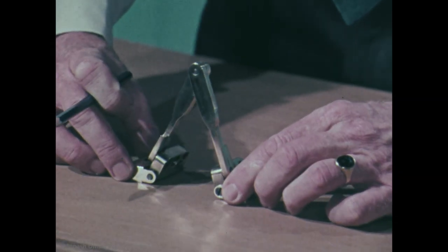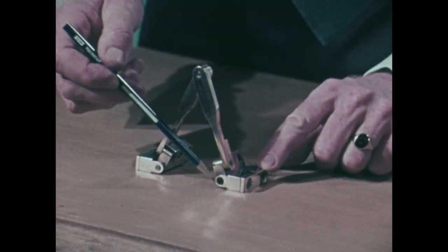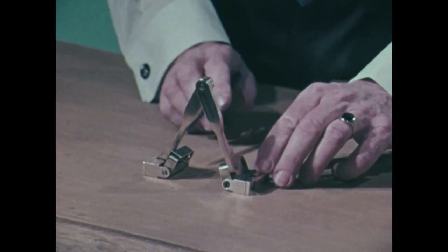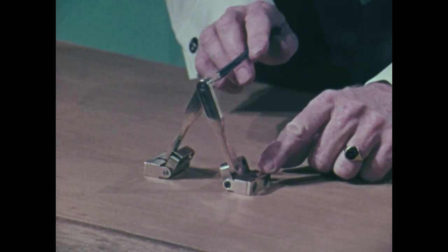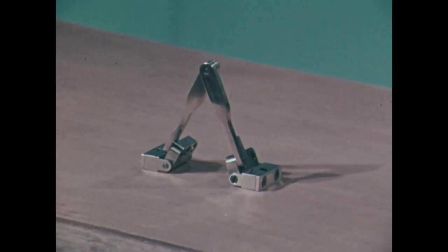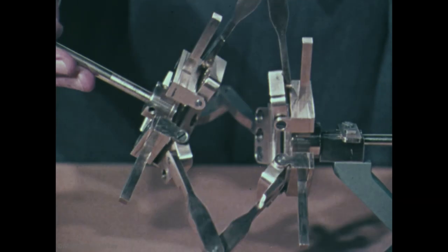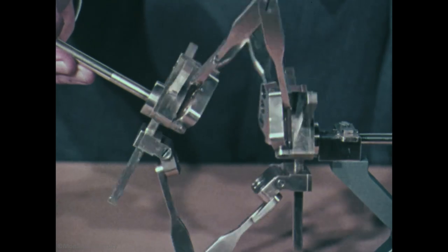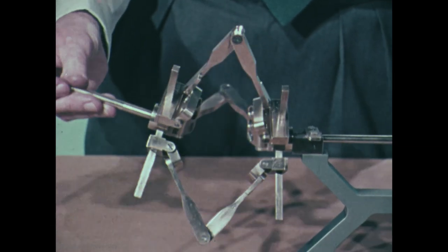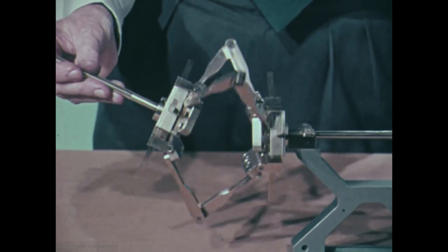This connecting chain has the required five degrees of freedom in its five hinges that do not intersect at all. Their axes are all arranged at right angles to their neighbors, and all the proportions of the chain are symmetrical about the central hinge axis. So this form of connecting chain can be used multiply to form a coupling, and here is a model of one with three connecting chains. You can see the symmetry. The coupling always constrains the shafts to intersect at the geometrical center, and it transmits uniform drive with plunging.